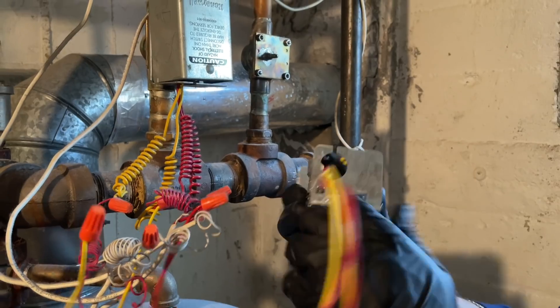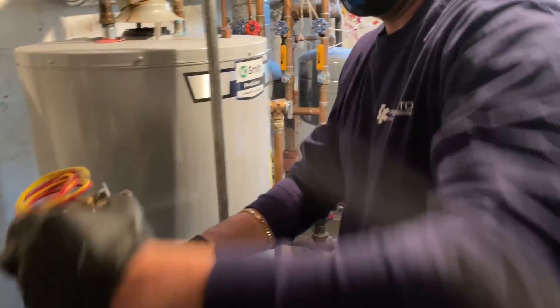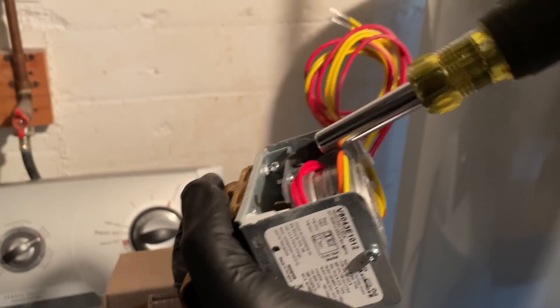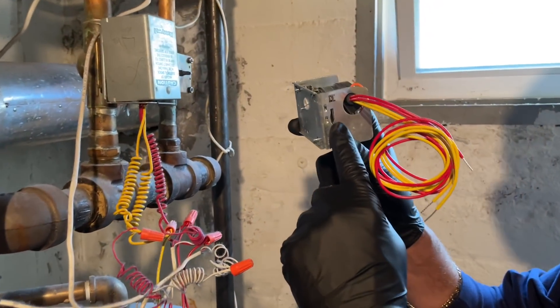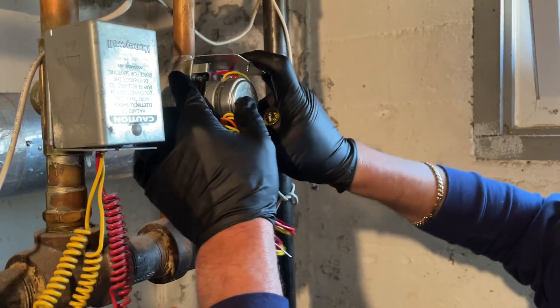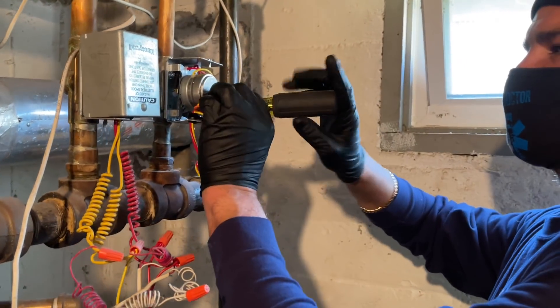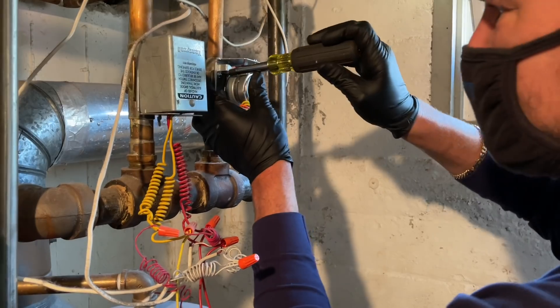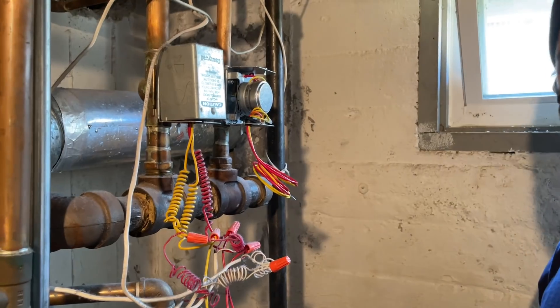So clear review. There's that screw, and the screw stays in there. It won't fall out on you. She comes manually open — you want to keep that, it makes it easier to go on. Just like that, it snaps into place. A little wiggle on it. Tighten up your two screws. And then we can go over the wiring, the end switch wiring and 24-volt wiring. We'll clean up this a little bit because the wire nuts you really shouldn't reuse. So now she's in. I'll open up the manual hold. Now she's closing. We'll take the cover and put the cover on.